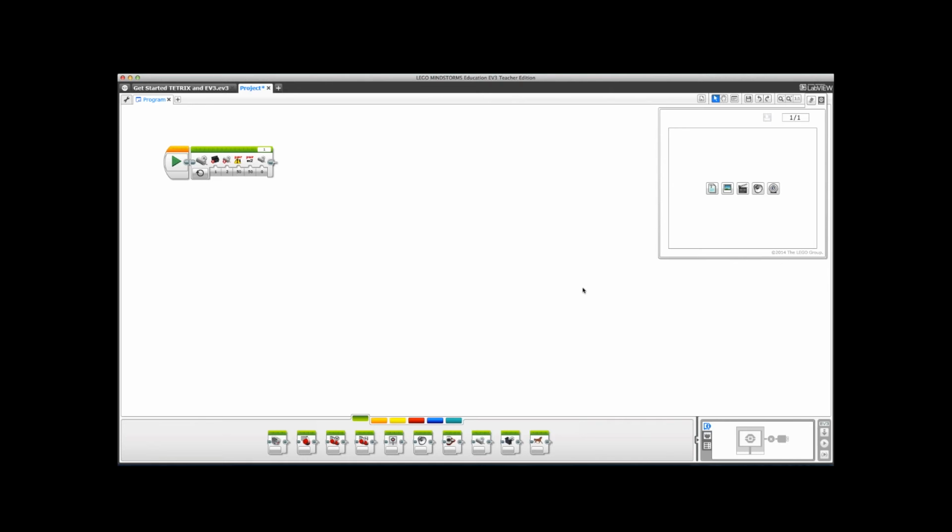After constant speed, we can tell it to move degrees, just like you could with a Lego motor, if you've got an encoder. So you'll see that with a lot of the functionality of these blocks, if you don't have encoders, you're going to miss out on some of the available features that you can use with the programming block. Again, I can choose a power level, and in addition to a power level, I can tell it how many degrees I want to move. And remember that a full rotation is 360 degrees. So if I put in a value of 720, obviously I'm asking it to turn 2 full rotations.